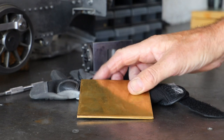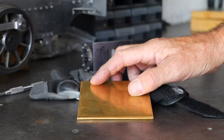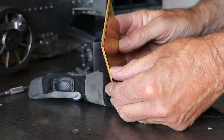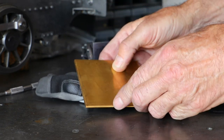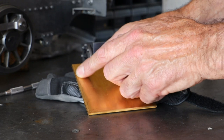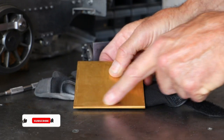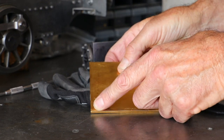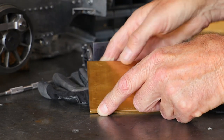In the meantime, the material for the steam chest cover arrived - this is 4mm brass sheet. It looks like it's been guillotined and the edges are a little beveled, which means I can't use any of the existing edges when cutting to size. I use a hacksaw to roughly cut it to size and then finish off in the milling machine using an end mill.